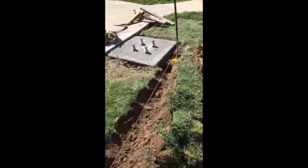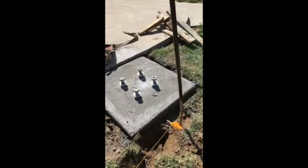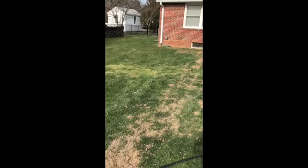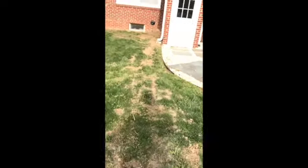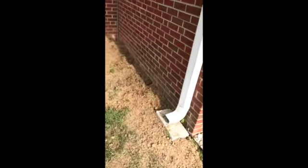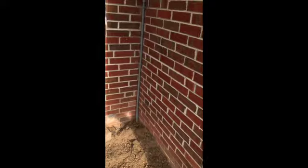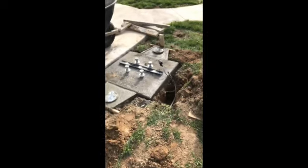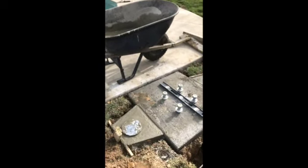and then I matched up my lines right near the base of my pole, and then on each side of that base, I actually installed the lights that I showed you an example of. They're waterproof lights. And how I did that was I framed out some forms on each side of the base of the pole, and I came in from underneath with my electrical source for my lights. And you can see in this photo where the lights are placed. And I did pour concrete around them.